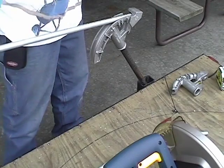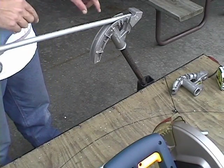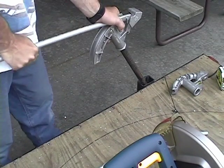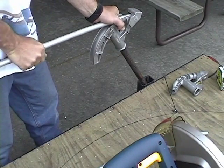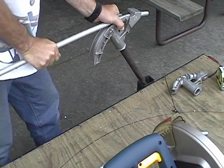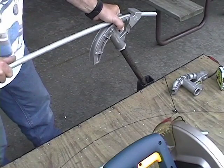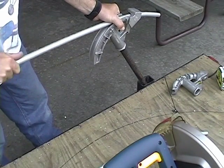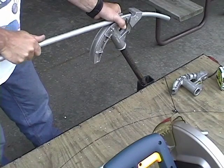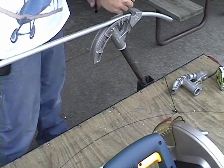Watch as it goes through that it stays lined up with the handle so it lays nice and flat. Do not use these marks to keep it straight, because the tube will twist as it goes through the bender. When you're going to pick it up, put a mark so you know where you ended.